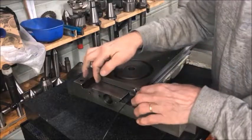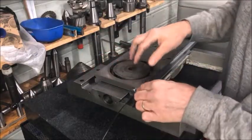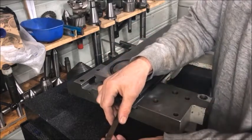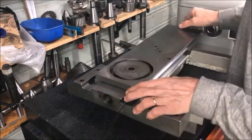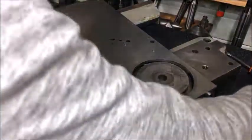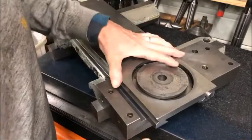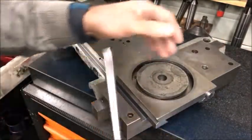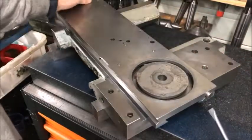Now I assembled the two pieces together and then inserted the gib, which is too shallow. So this is now backed up by a two-tenths of a millimeter shim. From another angle, I assembled again and snugged up the gib. And this is now tight and snug.